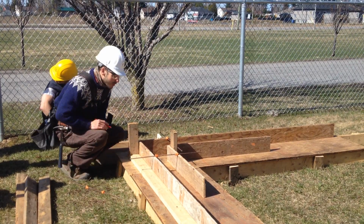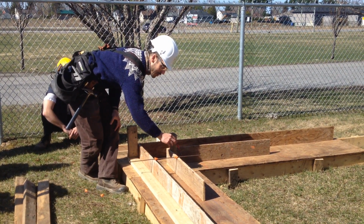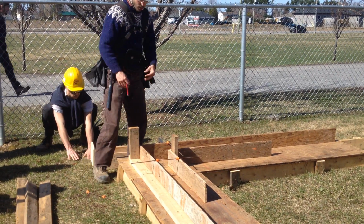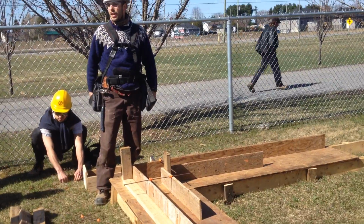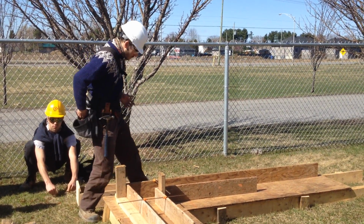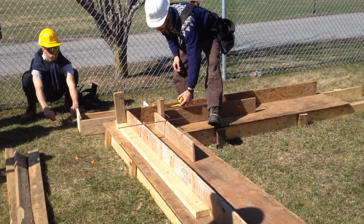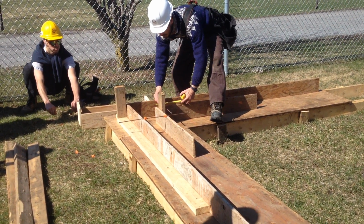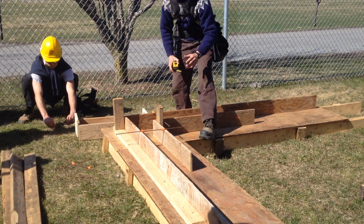And for the layout, what is the distance from here to the inside? What is the distance from here to here? Is it 3 inches now? We said 3 inches between the tie rods as a rule of thumb, just so that we have a measurement to go with. I said that if you have 3 inches from the inside of the form to this first rod, and if you have 3 inches between those two rods, you're in business.